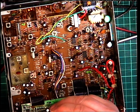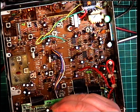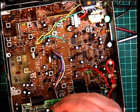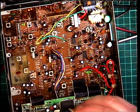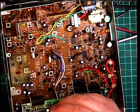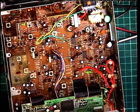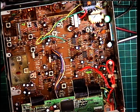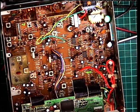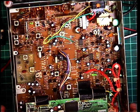Clockwise is increase. We're on quite a slow count for the accuracy on this — it's a one-second count. Just edge it up bit by bit. It's getting there... just short. Crystals can drop with age and eventually need replacing, but it's going to be within where it needs to be. 27.79.121 is the best I can get. Presumably that's a 10.24 crystal and we could change it if needed to bring it up further. But we're alright.